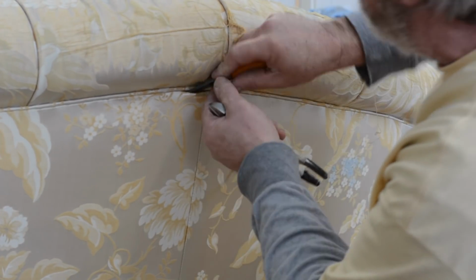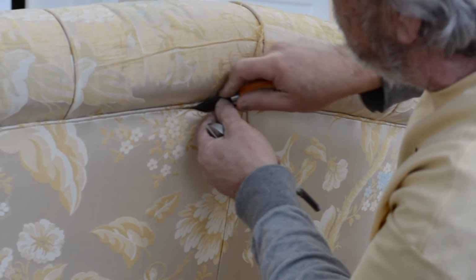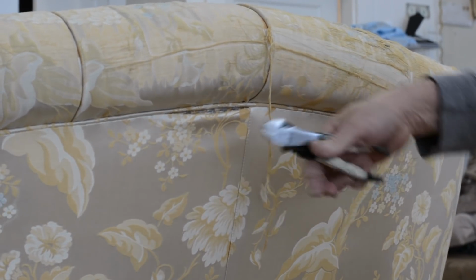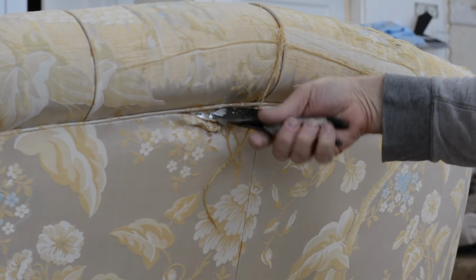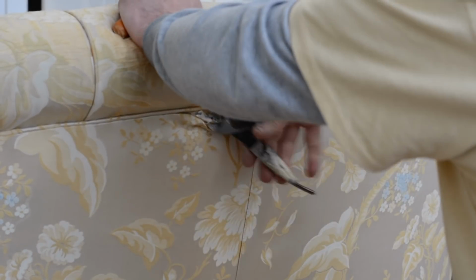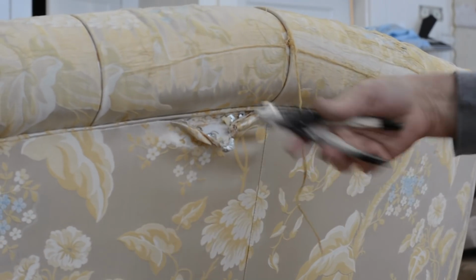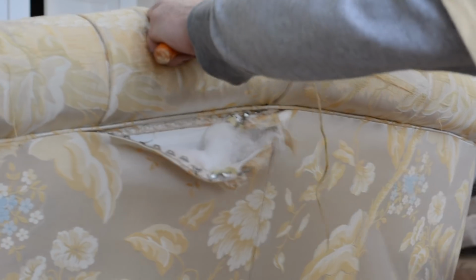I'm holding this on, and ply grip is that metal material that you've seen with the prongs in it that helps close up the outside. The nice thing about this ply grip is that once you get it going, you should be able to rip it. So what I'm doing is I'm taking my side cutters and I'm rolling it. I'm trying to get it started to get a grip on it. I've got a grip on it, so I'm going to pull.